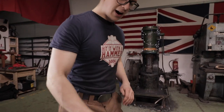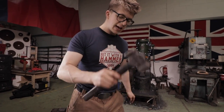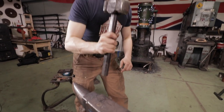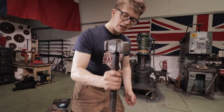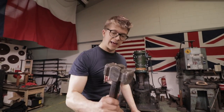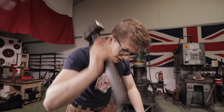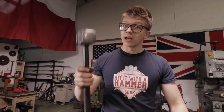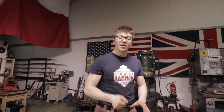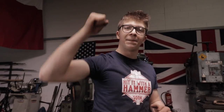When our hammer is out here, we're putting a lot of rotational force on our wrist. However, when it bounces off the anvil, you can let that hammer come straight above the point of rotation at your wrist, which means it's a lot easier to lift up like this. You're not torquing your wrist and tiring out your forearm because as soon as it hits, that hammer is in a vertical position, putting a lot less leverage on your wrist. So the key is you relax to the point that you swing hard enough that you get the bounce back to lift the hammer up in a way that's not torquing on yourself quite so much.